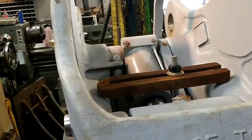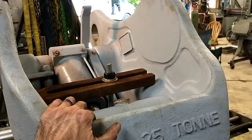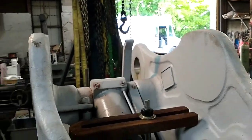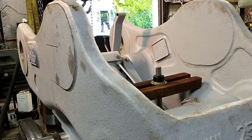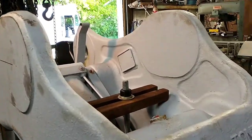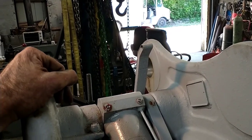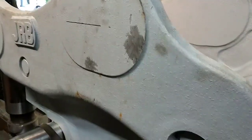I don't even know how long these have been sitting around. They were a discontinued model. That's how come they were sitting around unmachined. So that ear has warped out. This one is actually still pretty square is what I discovered. And so that's just a note to keep in mind. When you see castings like this, iron, steel, it doesn't much matter, if they get cast and then get machined right away, there is pretty much guaranteed going to be some of this kind of stuff happening.